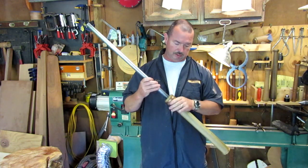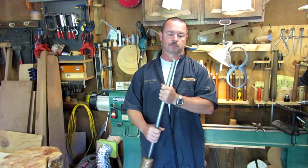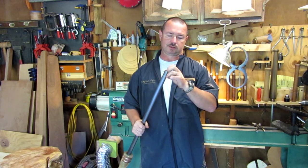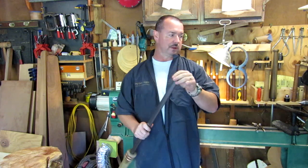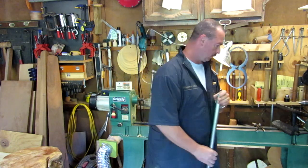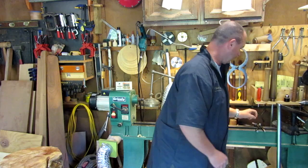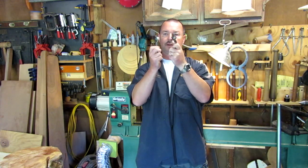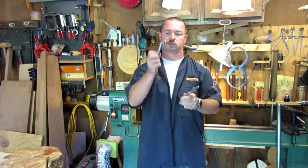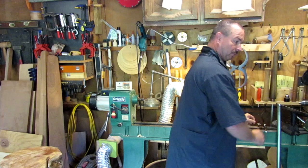It's a bar. It's a 1 inch steel bar, and I've put a half inch hole right in the middle here with a 1/4-20 set screw. Really heavy, and I've made these cutter tips for it. Here, one's curved and one's straight, and the little heads are interchangeable.